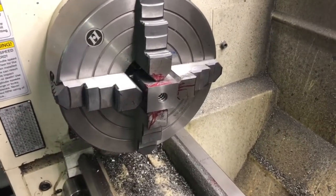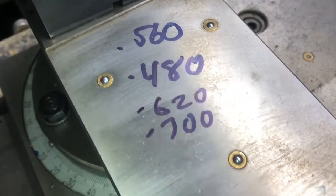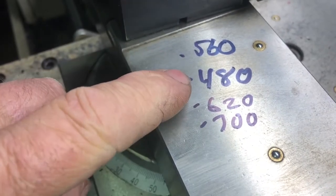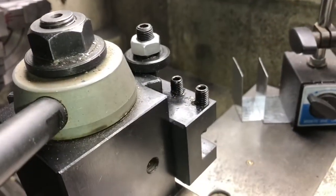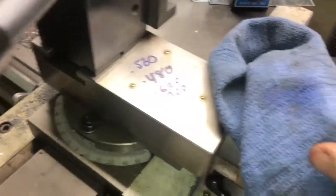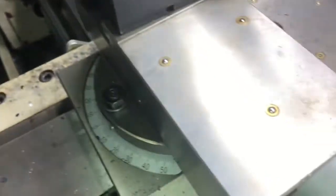When I'm boring these bullet molds, one thing I do is write my measurements down. I just shoot a little carb cleaner on a rag — it's like a magic eraser, wipes it right off so your lathe stays clean. Just write it on with a Sharpie marker.